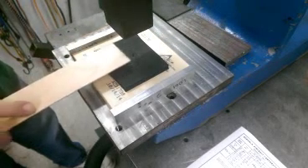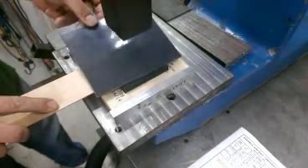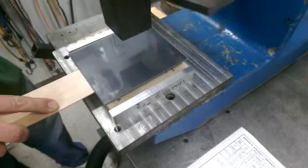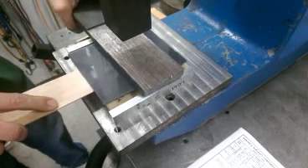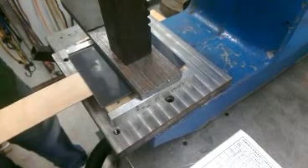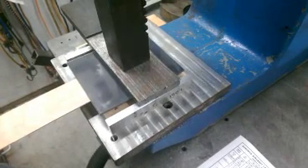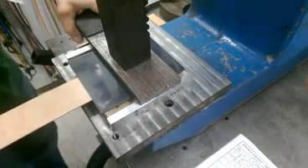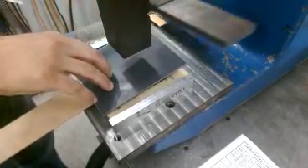What we simply do is put down our gusset material, which is a three-ply 1/16 inch, then put the sacrificial material — which is a piece of phenolic — and put our press plate on here. Then we bring the arbor press down using the handle outside the frame of the picture and pull on it until it snaps.